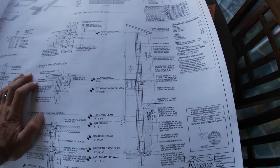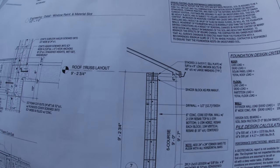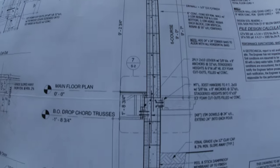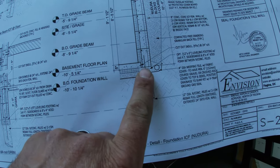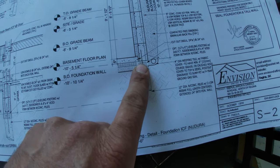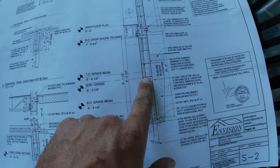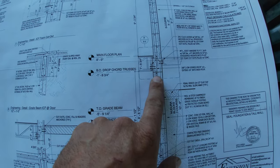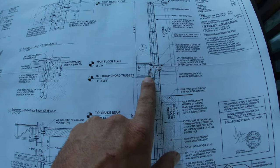So this is the engineered drawing of our house, the structural drawing. This is the walls that we're building, the ICF wall, right up to the roof line there. And this is how it's all pulled together. So starting down here, that's the piles. It sits on an optional footing. We put the footing in, just to make it a nice level place to work off of. And then our basement course of blocks. And then up to where the floor attaches here. This is that detail, blown up a little bit,